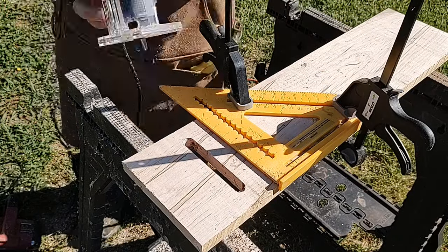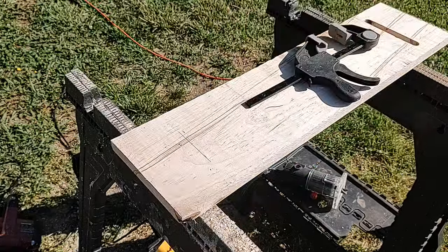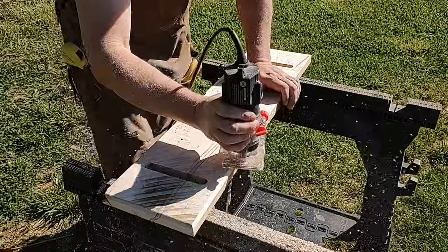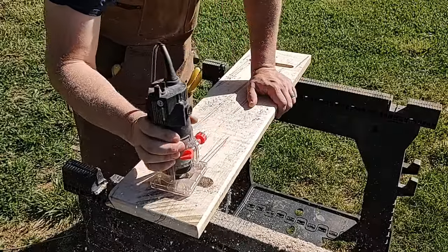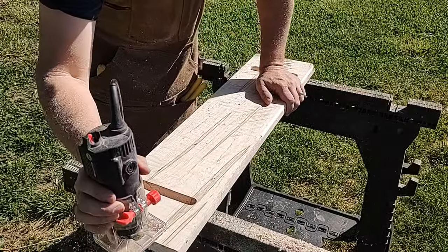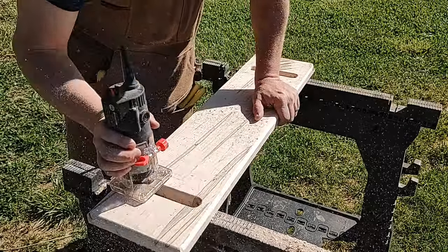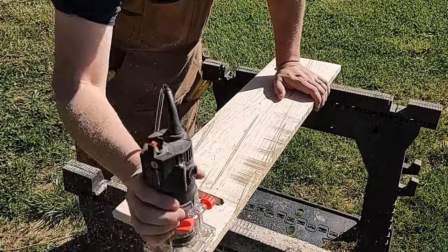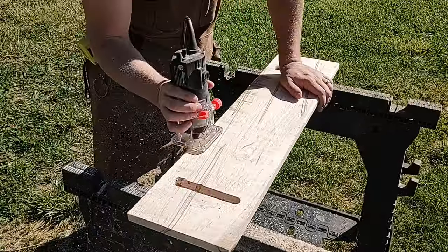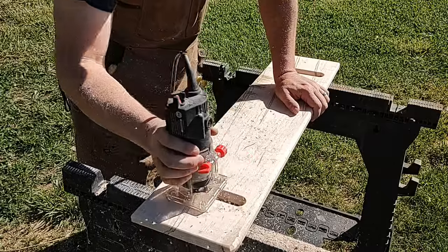This is the same lady I gave that rustic walnut bowl to. When I started sanding, I didn't get rid of the rough-sawn marks — I just let those stay. Here I'm routing all the edges, and this still fascinates me. I've been seriously woodworking for over a year now, but it amazes me how this one step makes something look so much more finished and professional. If you haven't bought that little $30 router from Harbor Freight, it's great to have. You can keep different router bits on different routers so you don't have to keep changing them out.